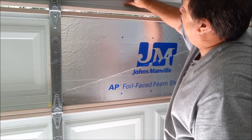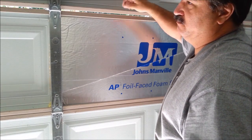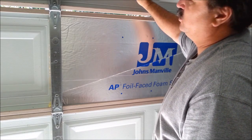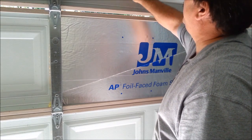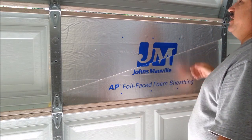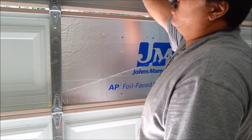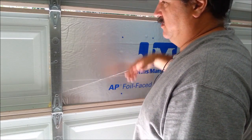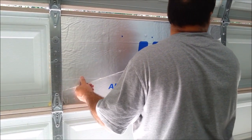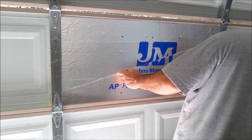And they had these pads that you glued in, or peel and stick adhesive, and then a pin would stick out and you would put a washer over it that would grab the pin, and that's what held the batted insulation. It would probably go up really quick. But I got a feeling when the sun was on the door and it warmed up, those pads would be letting loose, and it would just be one of those projects where you regretted not going ahead and doing it all the way right.